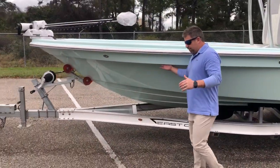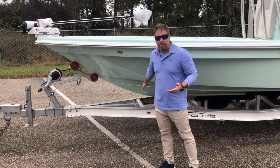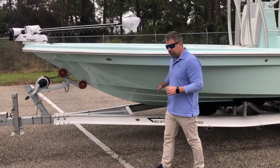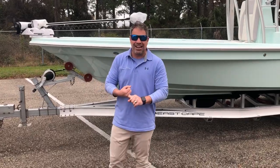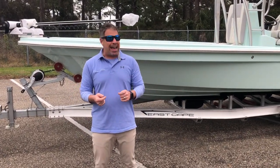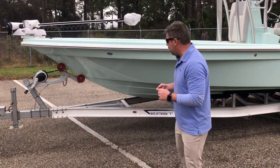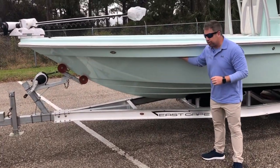The magic in this boat — the real design feature on the East Cape Bay — is going to be the spray rails. Traditional bay boats always have a hard chine running forward; some have them come up a bit and then do an inverted chine. We did the same thing. This is a traditional bottom: no step, no pad — it is not needed. The boat runs efficiently in good conditions, but when the weather is bad, that's where this boat will shine and pass the majority of boats.